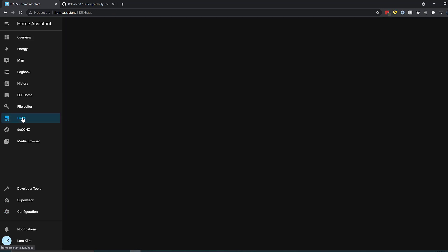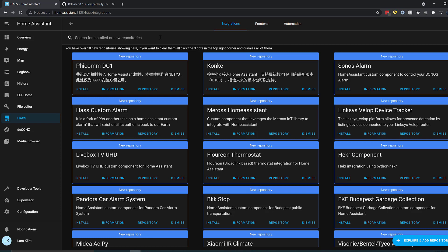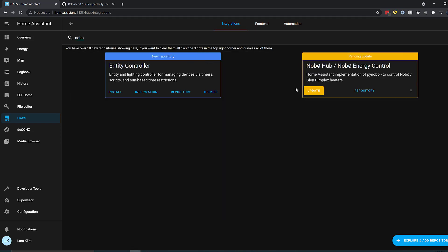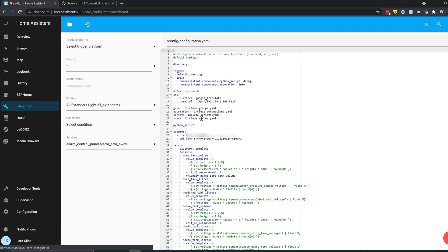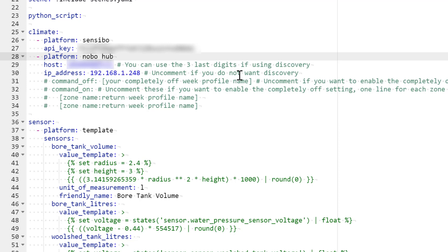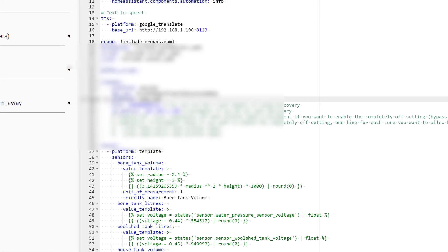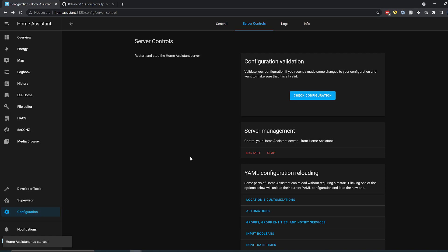After restarting, you can now use Home Assistant with the Nobo heaters. Don't update to 1.1.3 when HACS prompts you. There's no visual integration to click through — you just update the configuration YAML. This is a climate integration. Copy the code from the GitHub repo: set the platform to nobo_hub, enter the 12-digit serial number as the host, and the IP address. I couldn't use discovery mode, but that's all you need. One extra feature: if you want to fully turn off the heaters, they only go down to 7 degrees, so there's a workaround for that — I'm happy to leave them at 7 degrees.